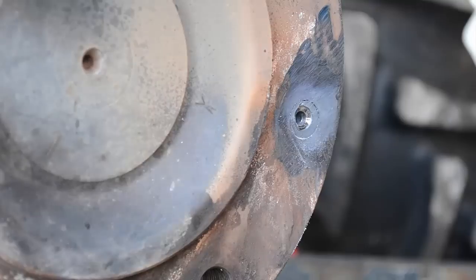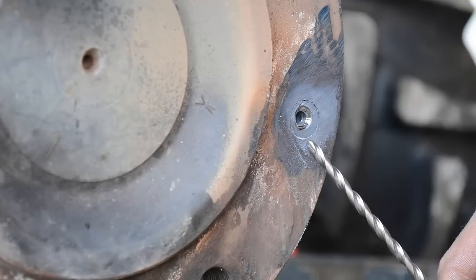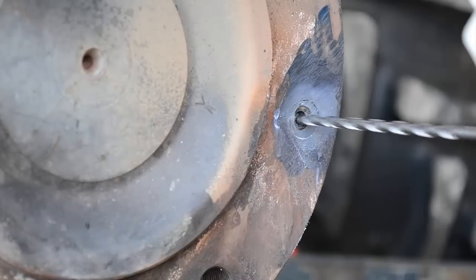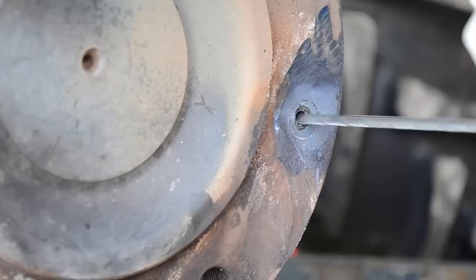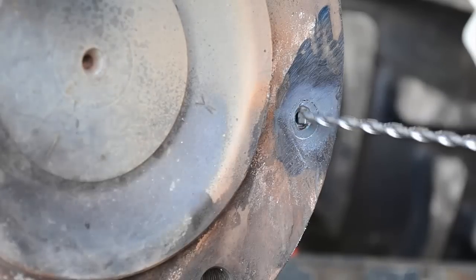So, you gotta go to plan B, which is a masonry bit. It's a carbide brazed on or soldered onto the end, and that will go through that. You can buy these just about anywhere. This is what you get broke taps out with. So be sure you don't get them too hot, because that solder will come off of them.